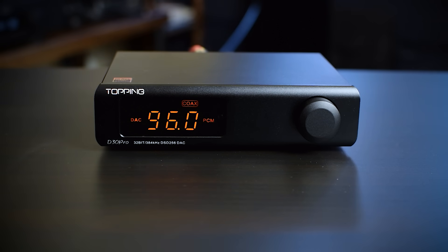The last option is the Screen Auto-Off function. If you set it to AC, the display will automatically turn off after 30 seconds of inactivity. If you set it to A0, it stays on at all times so you can always see sample rates, selected inputs, and so on.